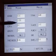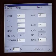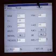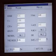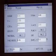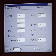You will notice these are your set points. The Y equal is what the computer says it needs to be at. You manually will set your X axis where you want your back gauge to be, and in this case, the R axis where you would like it to be. On top, these numbers reflect where the machine actually is. In this case, you are 1/1000th different from what the computer said is needed to do this bend.